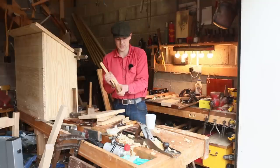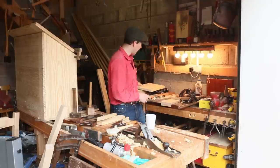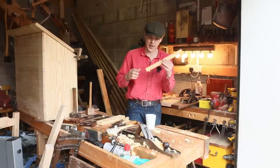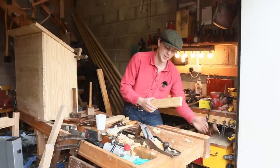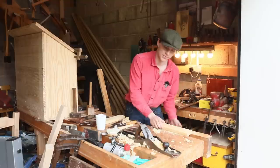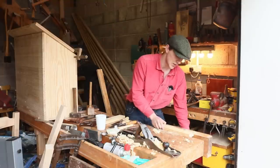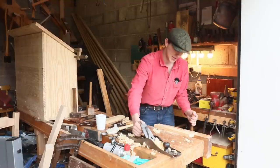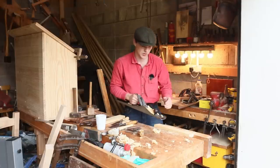The first thing I need to do is get everything lined up here. To start off I have my southern yellow pine pieces and I'm going to chuck them in the vise here. I'm going to use the big plane there — the Stanley number eight — and I'm going to use that to make one perfect flat reference plane, which we can then use to get the rest of the piece of wood square and even.